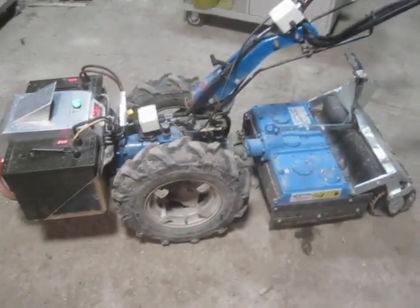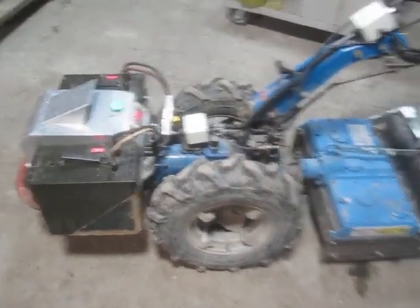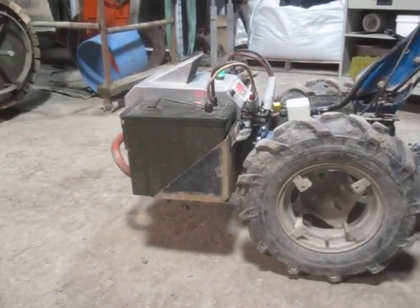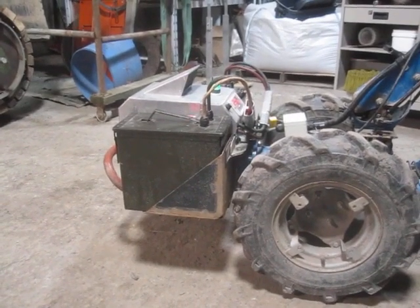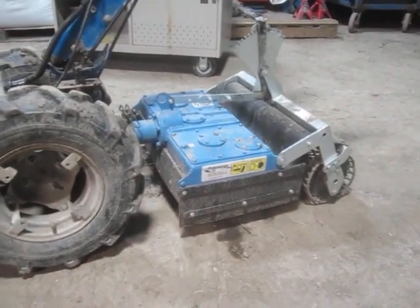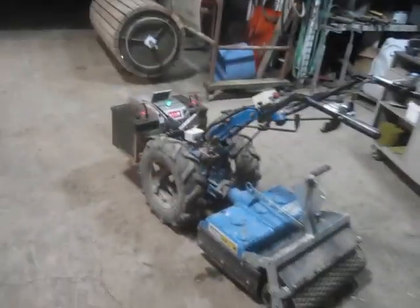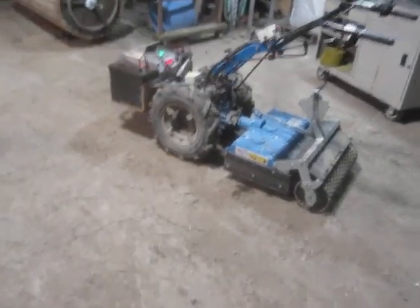Really good batteries are necessary for the power output and it couldn't be done in the era of lead batteries, because as you can clearly see this machine is balanced on its wheels. The weight at rear needs to be a little bit more than the weight at front, and if you put 300 pounds of lead up front you'd have to put a whole lot of counterweight on the rear and it becomes useless. So I'm going to put this on the tripod and demonstrate how it works, and then I'll go through the full geek-out tour.